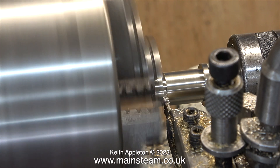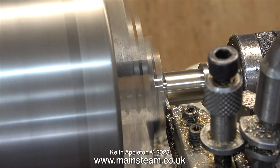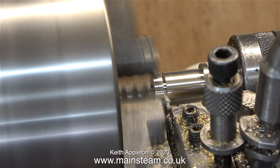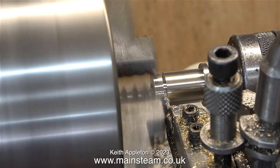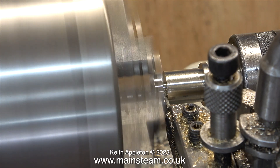I need this component to be shorter so I can use the bolt to pull the flywheel towards the crankshaft. If this bush was too long, I couldn't do that. And the crankshaft definitely needs to be right up against the main bearing to stop any side play on the crankshaft.